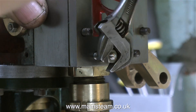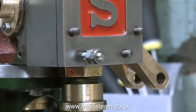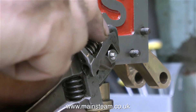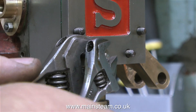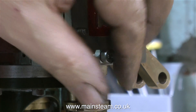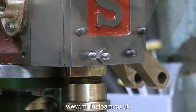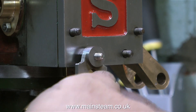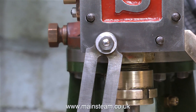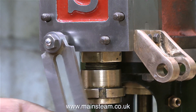To fit the stud through into the cylinder block I'm using a pair of lock nuts — this is the best way to fit studs. Once the stud is in the correct position, undo the lock nuts, remove the end lock nut, then turn the other nut so that it secures the steam chest cover to the steam chest. Then all you need to do is fit the anchor link, followed by the nut you've just removed to hold it in place. And that's it for the moment — thanks for watching, and I hope you found it useful.